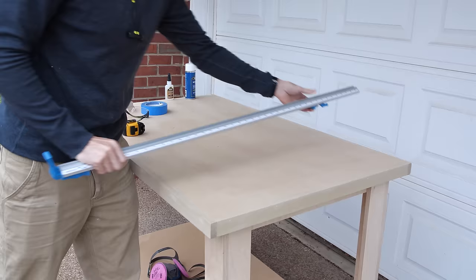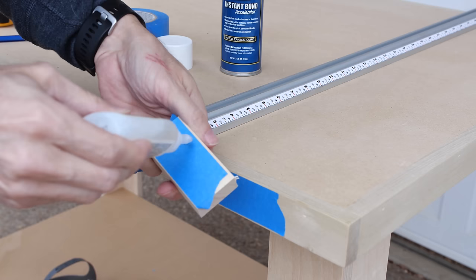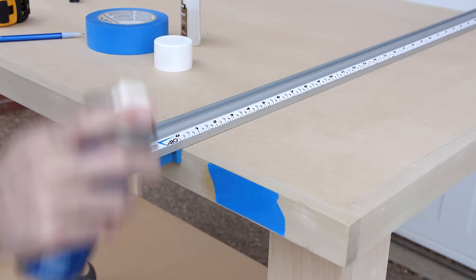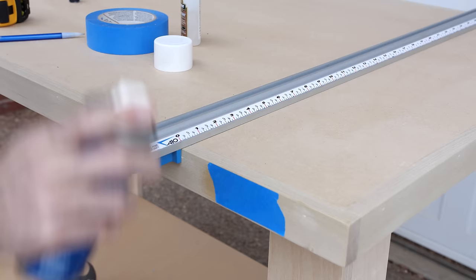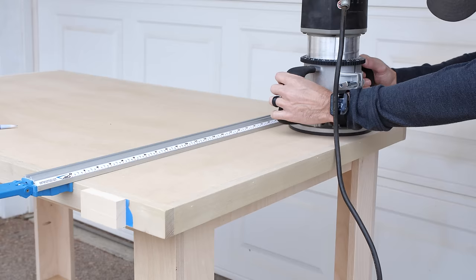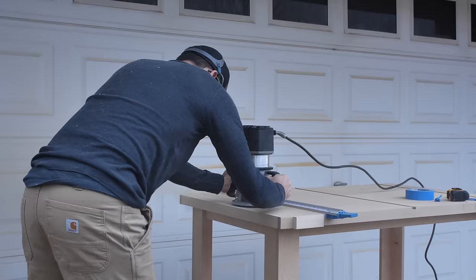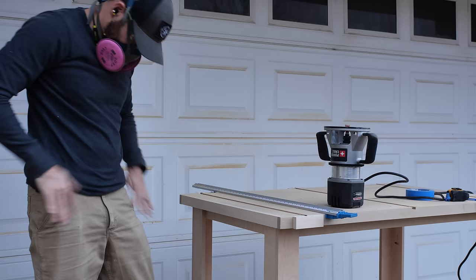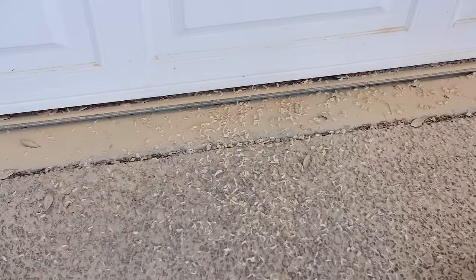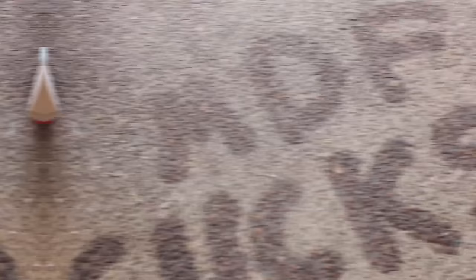The t-track is three quarters of an inch wide so I chucked up a three quarter inch bit in my router and set it to just over three eighths of an inch deep, which will put that track right below the surface. I positioned the dados for the track four inches from each end and one centered on the table. A straight edge clamp paired with the router makes the cut really easy. To avoid tear out going into and out of the cut I glued some sacrificial blocks onto the trim using painters tape and CA glue — a tip I picked up from my buddy Johnny Brook from Crafted Workshop. After cutting the first two slots I was kicking myself for using MDF. MDF is fine for a flat top but it is an absolute disaster to route. I would highly recommend using solid plywood if you have it — it worked, but the mounds of dust left everywhere were a complete mess.